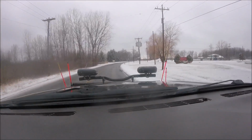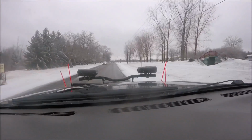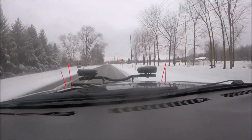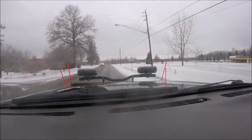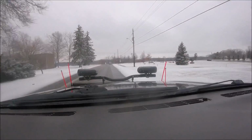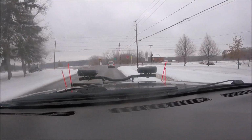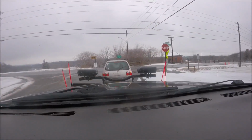It all looks good, but the plug where the 2 plugs plug in the back of the power box, those terminals were a little, like, not corroded, but like they weren't clean at all. So we cleaned them up real good, pumped some dielectric grease in there, plugged it back in, put it back in the truck, and it still was reading an error code. It wasn't working. So we pulled the lid off the hopper and shoveled a bunch of the salt out of the way that was left in there.